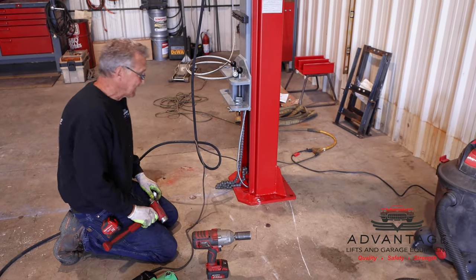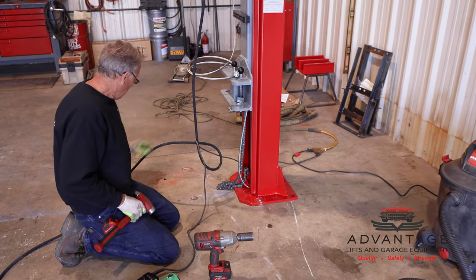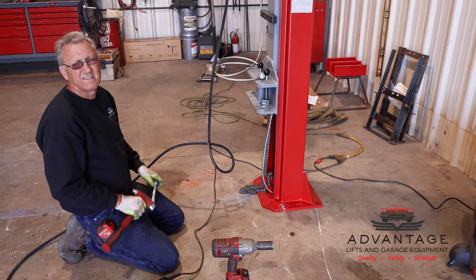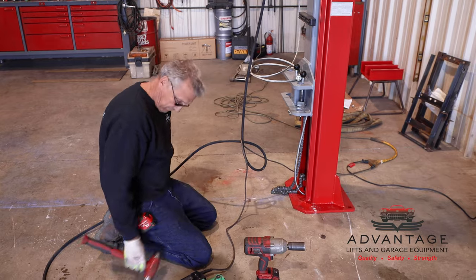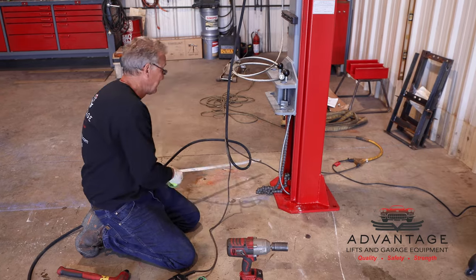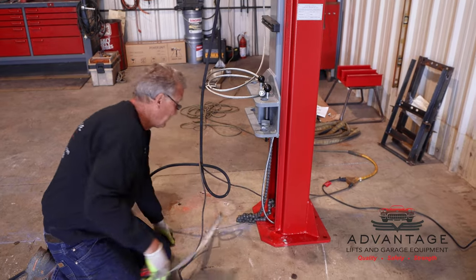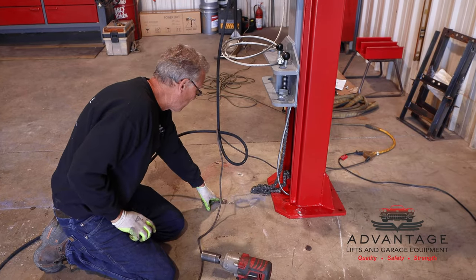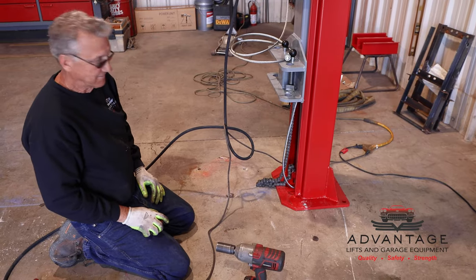What I didn't mention to you that I should have mentioned is, we talked about the joints. Well, you don't want your joints near any of your anchors. Well, also you don't want any cracks near your anchors. And again, what you're looking for is to stay about 6 inches away from any joint or crack with an anchor. We're plenty far away because our nearest crack is like 29 inches and our nearest joint is 18 inches. Okay, so now you can talk about these holes. Well, how far away do you have to stay from an existing hole? Well, if the hole is filled and it's not a hollow hole, you can be within 2 inches of that. Okay?